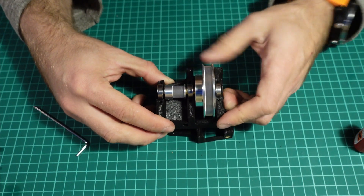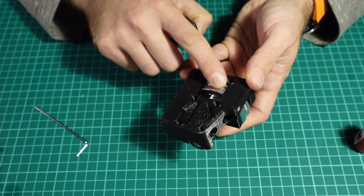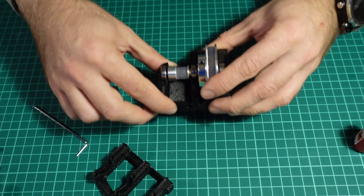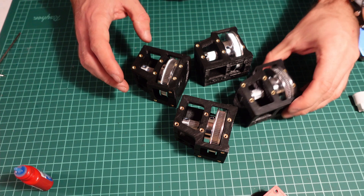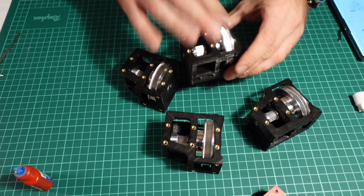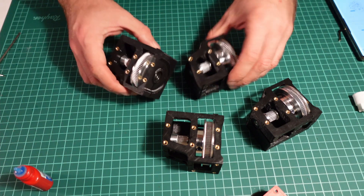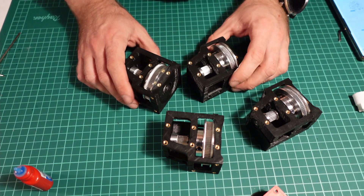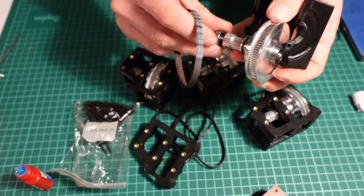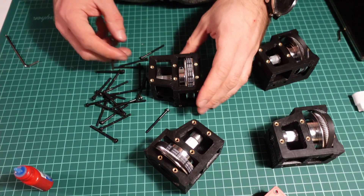When you're done, make sure both pulleys rotate freely. I've used the smaller part of the frame as a base because the pulley protrudes a bit from the bigger part — if you lay it flat on the table it will pop out. Repeat this for the other three pulleys. Now is a perfect time to check if everything is assembled correctly and slides freely, because disassembling the modules afterwards would be a huge headache. When you're satisfied, proceed with actual frame assembly: you'll need M3 40mm screws and GT looped belts — the only looped belts used in the construction. The belt should go over the pulley and through the hole in the smaller part.